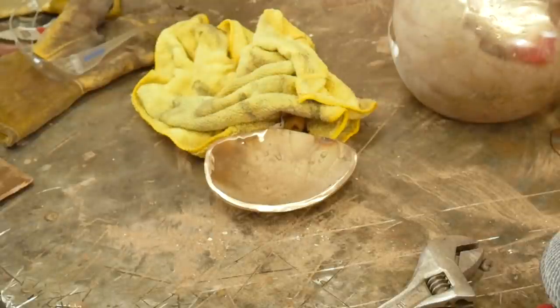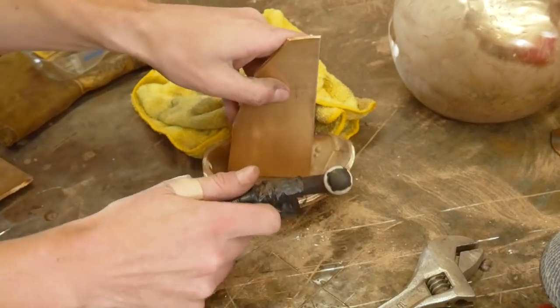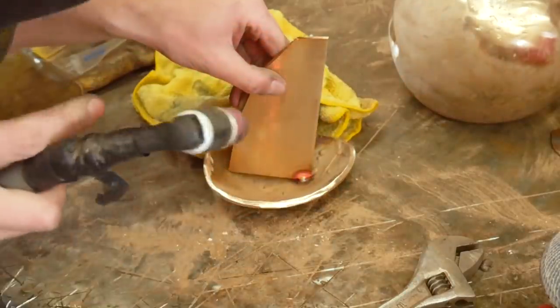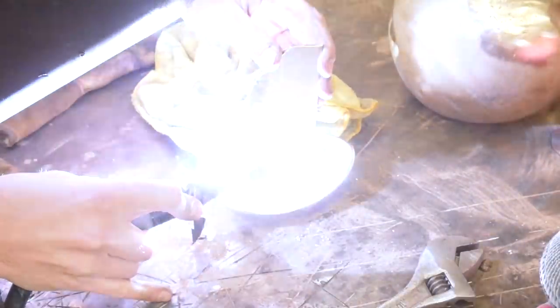In the early stages of building or rebuilding the sculpture, you want to knock out as much prep work as possible. Here I weld a sacrificial piece of plate into the big window so I can secure it in a vise. This holds it tight so I can sand it down without worrying about having to hold it or it moving around very much.